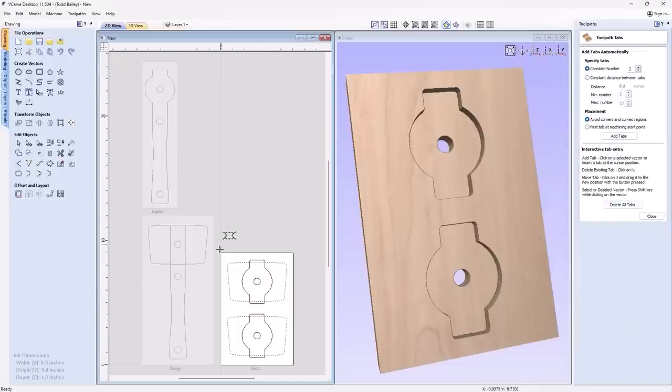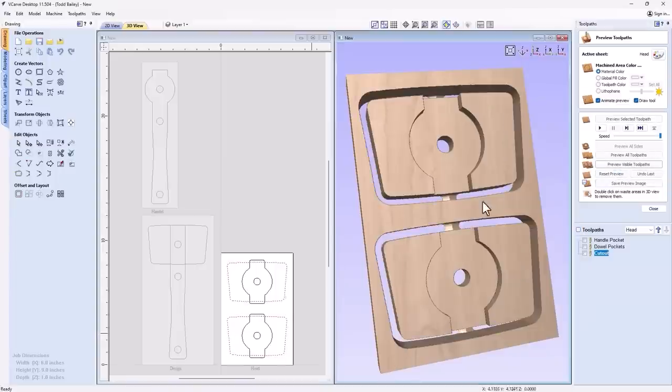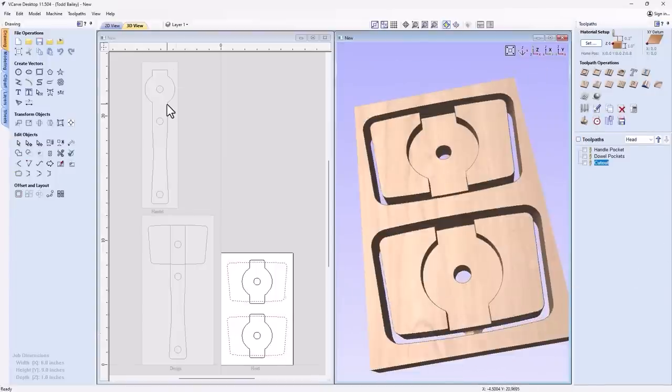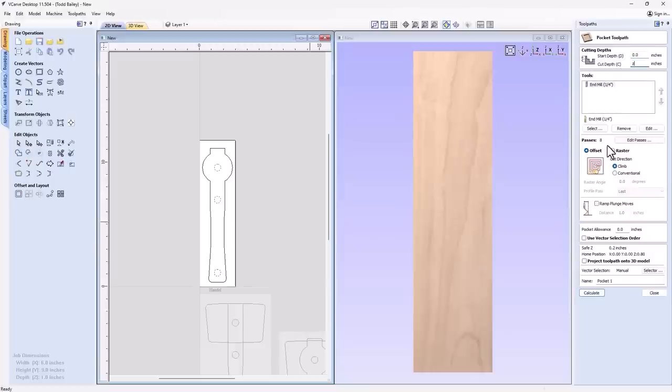Also, this might be another good tip. For jobs like this where you're using hardwood, using 3D tabs is the best practice because in the end you won't be leaving dwell marks behind that are really hard to sand out. Dwell marks are when your tool goes ahead and moves up and down in the same spot and ends up taking away more material than what you expect.